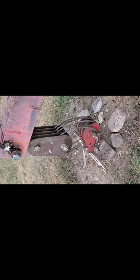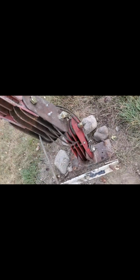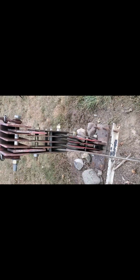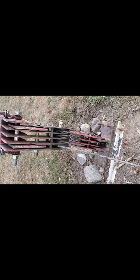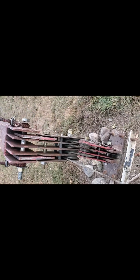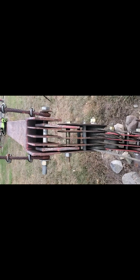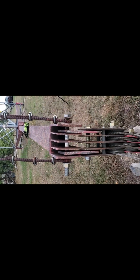I'm going to try and put you guys on rear facing camera and we'll see what happens, because I got a feeling the rear facing camera is probably a better deal. But anyway, there's the arrangement. I got basically a block and tackle kind of system there. I got 3 sheaves on the bottom, 4 sheaves up on top. We're going to throw some oil on there before we get started. I've got a link mechanism here, and that's going to the gin pole. So follow the cable back.